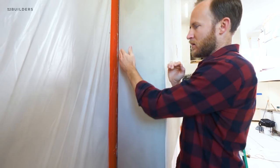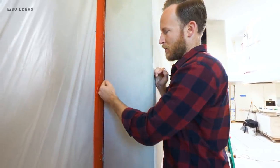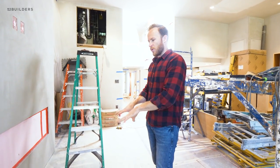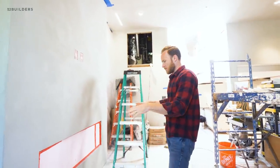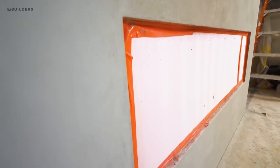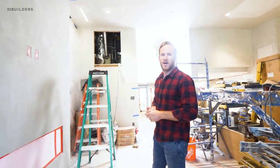We've also kept it off of the back plaster wall - where this is a painted plaster wall we wanted a clean separation. Rather than a caulk line or paint line, we've decided to keep it off that back wall a quarter inch, creating this concrete cube that essentially floats completely separated from the oak floor, the painted walls, and the painted ceiling. Those are really intricate details we have to think about thoroughly up front. Finally, the fireplace is completely trimless - we've run a stop bead and ran the plaster really tight to the fireplace, and we've prepped it for a television up top.